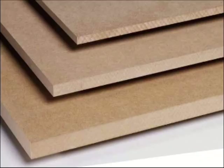Next is MDF board, which is inexpensive and available in a number of thicknesses from virtually any lumber yard or major retailers such as Home Depot or Lowe's. This panel is very rigid and generally not as likely to warp as plywood. The reason I don't really care for it is that it is a bit heavier than my favorite materials, and you really need the 1/4 inch at least thick variety to keep it from warping.